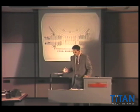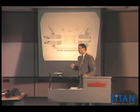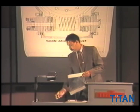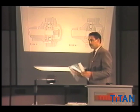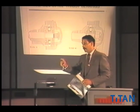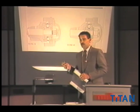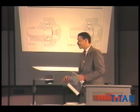The technology changed because they made a better style of that bearing. The better style, and I'll show you with this drawing, was that they incorporated a double acting thrust on one end — which would be this style. They encased the whole bearing on the back end of a traditional machine where the thrust bearing is today, so that it was double acting. Rather than having two sets of bearings on each end of the shaft, they incorporated all on one thrust end.